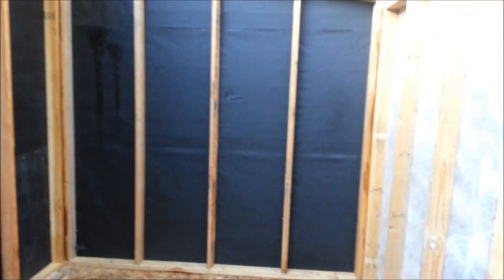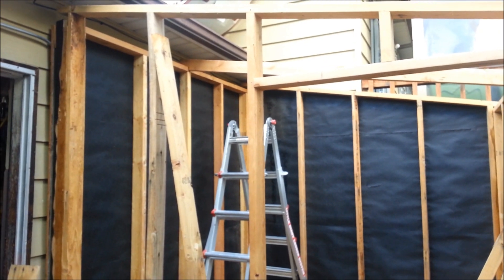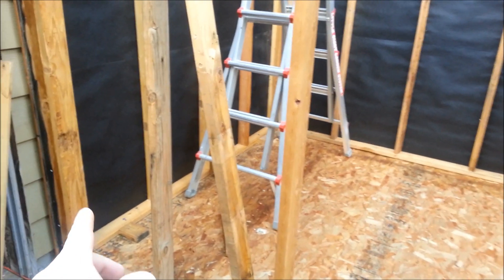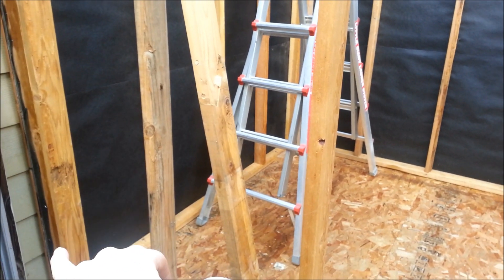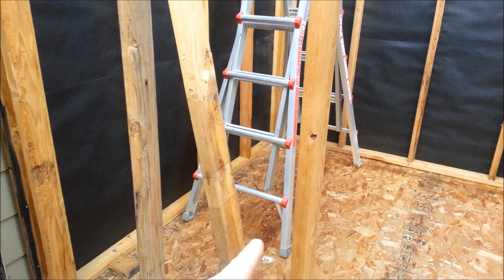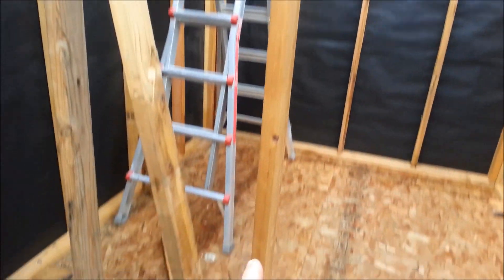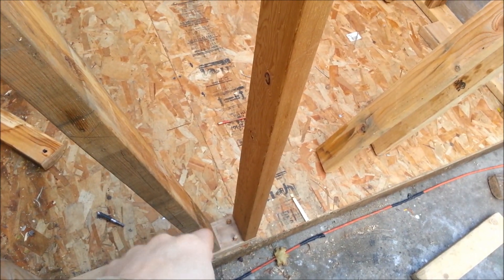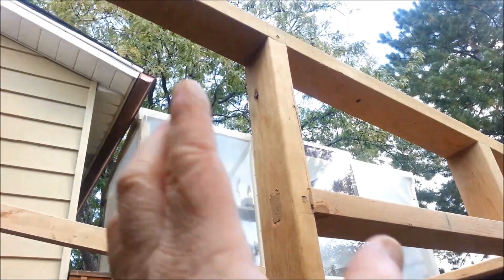So, just got one side left. But here we are. I got this wall leaning up now. I did run into an issue — my siding isn't long enough to staple between here and here. So I needed to put up another board. But I've already mortised and tenoned all this, so I doweled it at the bottom and I'll put it down, and then I will put it up against it.